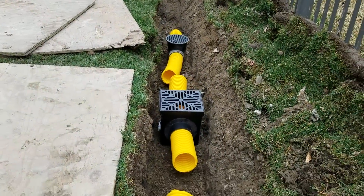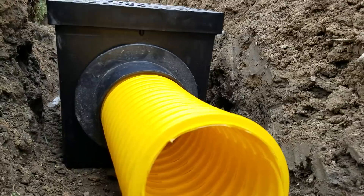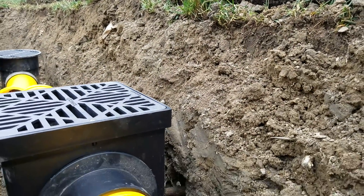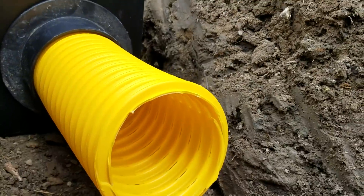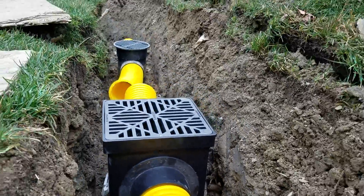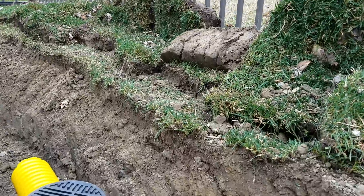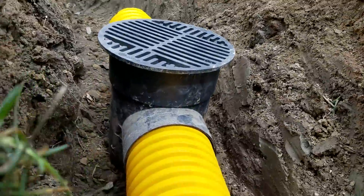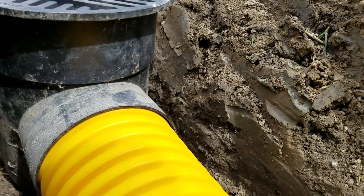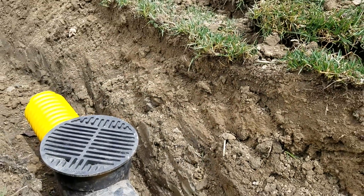I think it really helps to see it like this. Here's a nine by nine — these are the same guys telling you they're going 24 inches deep. Look how low it sits in here. You're not going to get all the water; you're not getting to the bottom of the trench. You're actually damming your system — it's no different than having a dirt dam. And here's the six-inch: this is only eight inches tall, but they'll tell you they're going 24 inches deep.